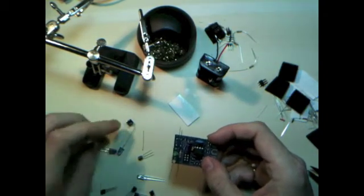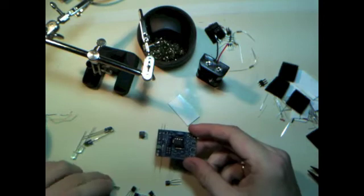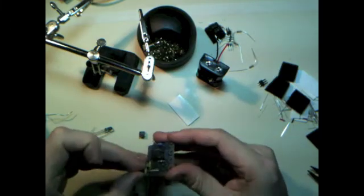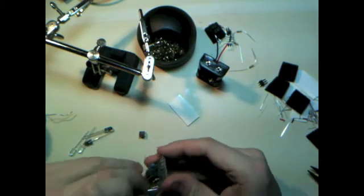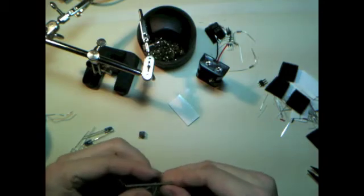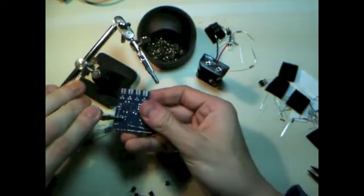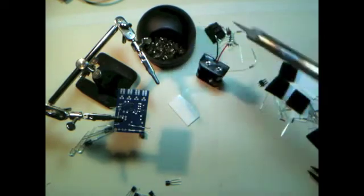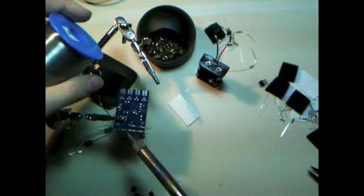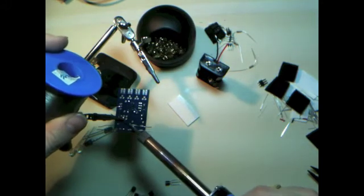Now I just put in the LED — this is one of those ones you have to put in the right way. Adafruit do a really great job with their circuit boards; that's Adafruit.com. They make sure their boards are all very clearly labeled. And here goes one of the transistors — this would be the 2907. The difference between the 2907 and the 2222: the 2907 has three straight legs, perfectly straight, and the 2222s are bent out a bit like a fork. The legs are a little bit wider — it's got a bit of a cowboy stance, if you will.